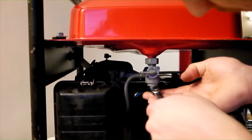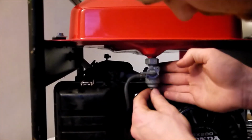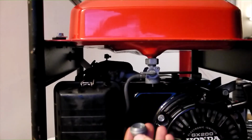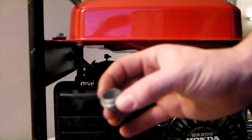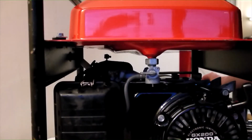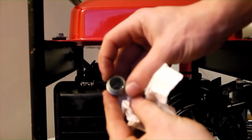A great feature on this generator is the fuel strainer. These are usually only fitted to diesel engines, so full marks to Honda for fitting it here. Having checked the fuel supply is off, the fuel strainer is removed in a similar fashion to the fuel bowl on the carburettor. The strainer screws onto the fuel tap directly and becomes free by use of the socket or spanner. Keep a bowl handy to tip the fuel into, which has a great deal of contaminants, as you might see here. The fuel strainer is designed to separate any water that may be contaminating the fuel. This is often a problem on generator sets such as these, where they are often left outside in wet conditions when running for extended periods.